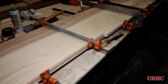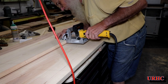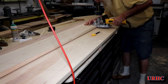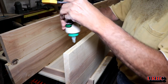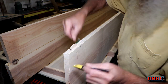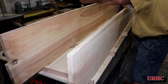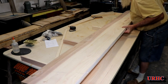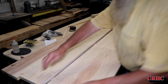I'm gluing up the first two slices there, and they did come out nice and flat. Then I'm going to go back and put the last board on. This desktop actually comes out about 26 and a quarter inches wide overall — just about a standard counter width. Here I am just getting ready to biscuit and glue on that last piece. Things do start getting pretty heavy when you're dealing with pieces this big. Just another glue-up, trying to keep everything straight and flat, and luckily I've got a nice flat table to work on.